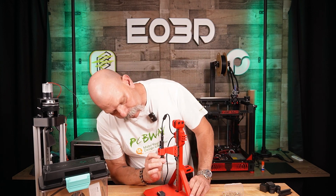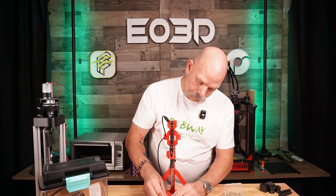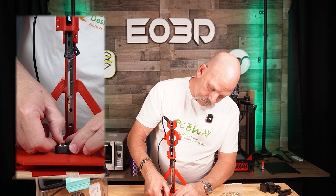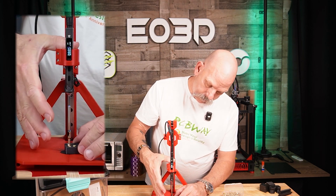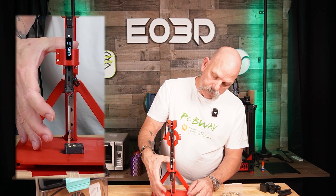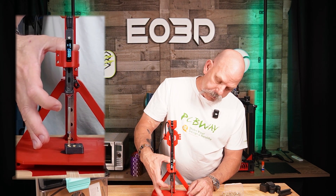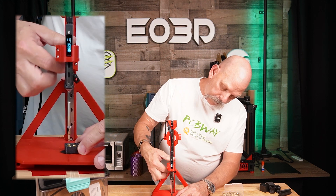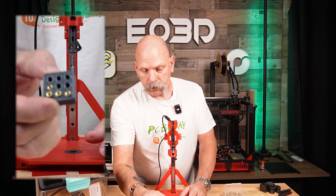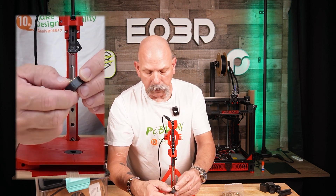Let's bump on up to 360. Let it heat soak for just a second, then put some pressure on it. It goes in a little easier at 360, and when I pull the iron out, it doesn't push back — as you can see. It's got a little bit more ooze out around the edge of the holes, which would have to be cleaned up.